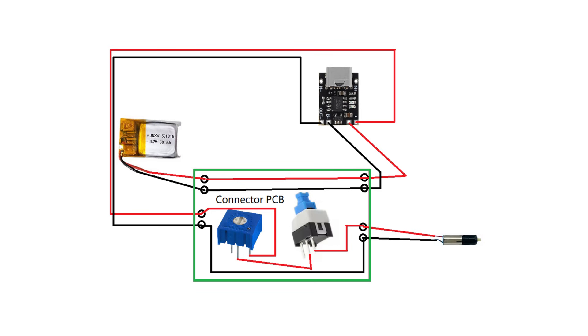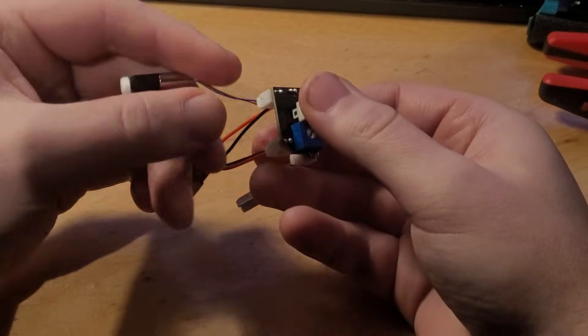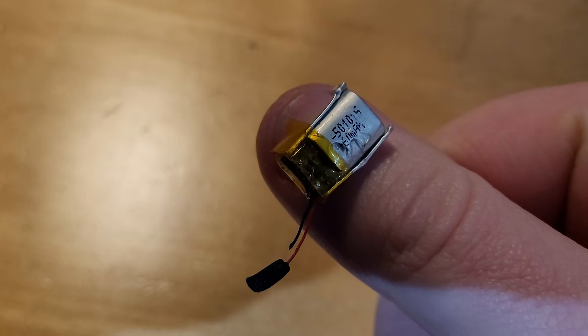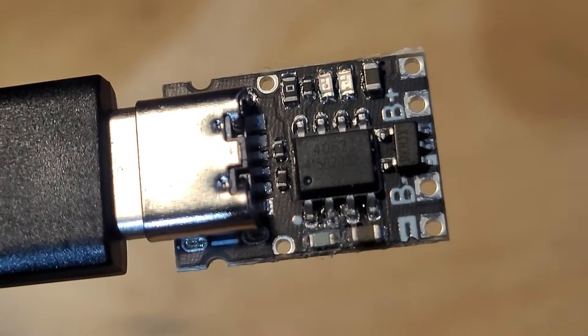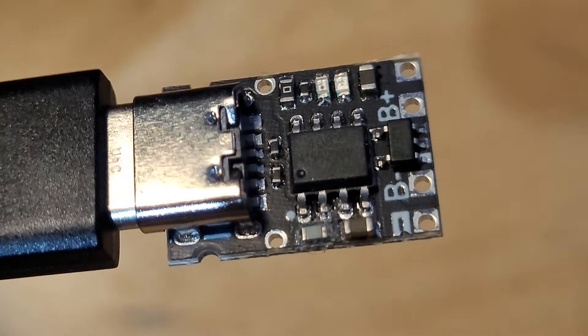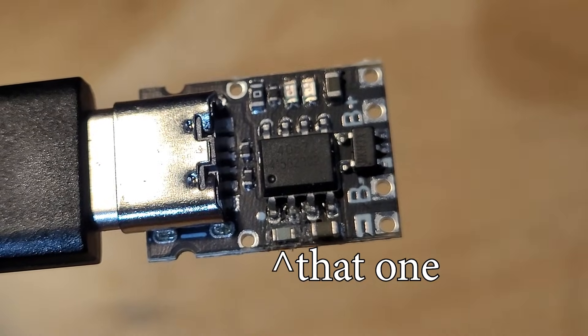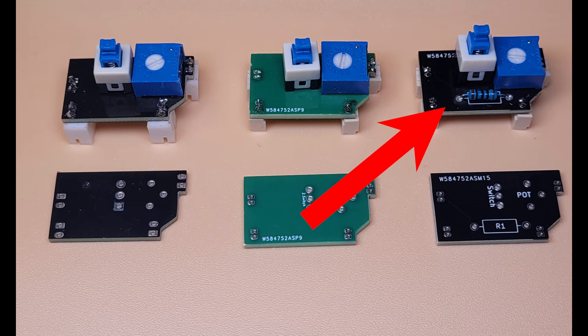The battery, the charging module, and the motor are all attached to the PCB through connectors, so you can easily replace any components if needed. The first test battery lasted about a minute before giving up on life. It turns out these charging circuits charge with one amp of current, which is a terrible idea for these tiny batteries. Who knew? I would have to replace a tiny resistor in order to change the charging current, but that looked way too small for me. So I tried to fix it with a current limiting resistor on my own PCB — and ladies and gentlemen, this is exactly why you do not make decisions at 1am.